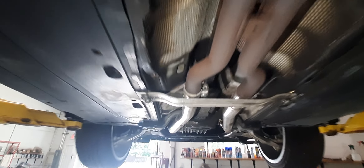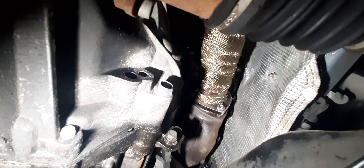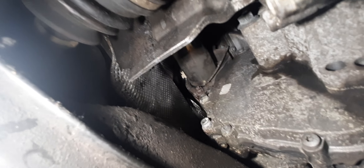I am not getting any smoke from the front, so I'm thinking it is not leaking up here. Although I did suspect it because there's a soot mark near the collector where it bolts up to the exhaust manifold. But I'm not seeing any smoke and I've had the machine running for a good solid 20-30 minutes.